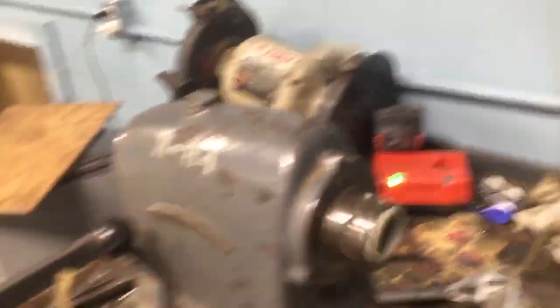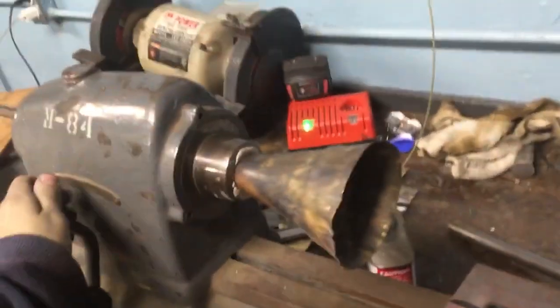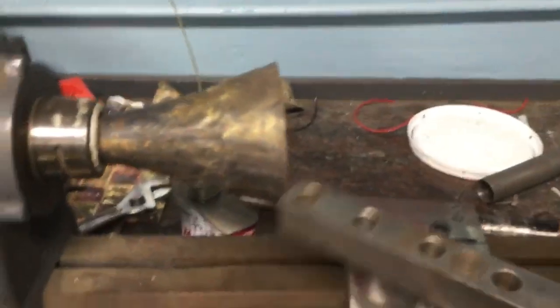That's why it's sounding a little sad. I got my spinning rest and I have an old scrap bell here I've been playing with — I might do some spinning on it. I was able to get the epoxy pretty concentric, concentric enough, because you have to remember that's a consumable item — it'll wear off after a while and wear itself in. It's got a little bit of wobble but could be the pattern. I also have to get a peen in the back to hold it centered, which will hold it tighter.